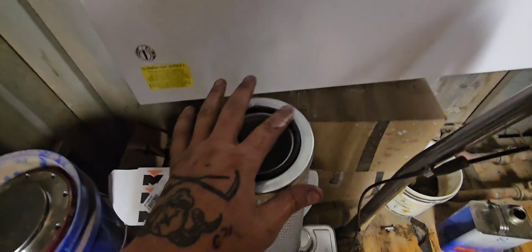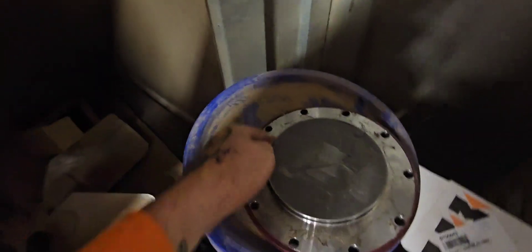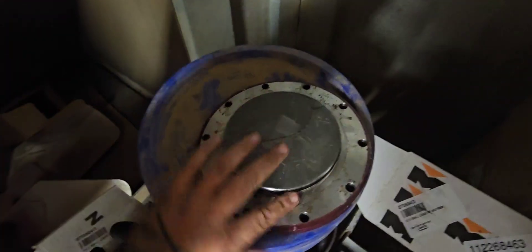What I'm going to do now is oil all of these o-rings that are on here. So this o-ring here — I'm going to get a little bit of oil and put it on this o-ring, just to help it seal. And then before you start this up, you're going to want to prime it with a gallon of oil.